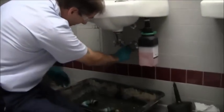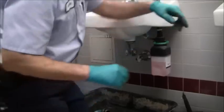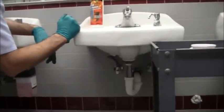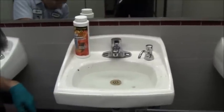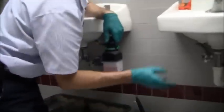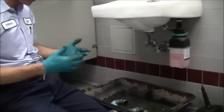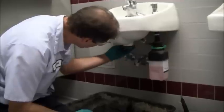Now, I need to do the tailpiece, but I don't want to smell sewer gases, so I'm going to put in a blocker there, just so I don't have to worry about that. This sink is backing up, so I still probably am going to have a problem anyways. Even though I was able to take out a section of the plug here, it looks like I'm going to still have a problem. But I'm going to have to button this all up together no matter what, so I shall start doing that. I'm going to remove the old basket strainer